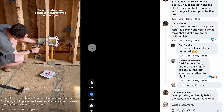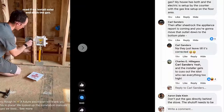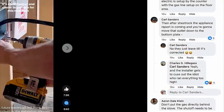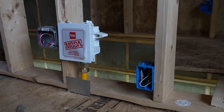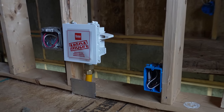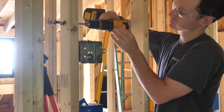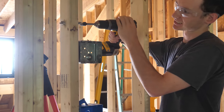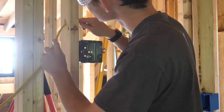I made a short-form video of this which sparked controversy from Facebook's electrician community, but one good piece of advice that came from all the comments was that stoves have an open area at the bottom to accommodate a plug or gas connector, so I did end up moving both of these boxes just above the floor. This circuit here is for the electric radiant floor system we're putting in the bathroom — much more to come on that.